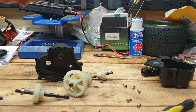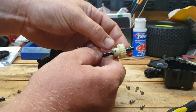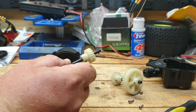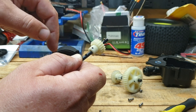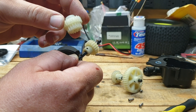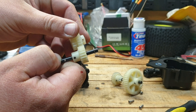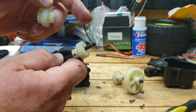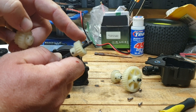The other thing is the gear that comes with the 5153X kit — the gear that comes with it is actually too big. You can't fit the gears in; the mesh isn't correct. So you end up having to punch the rolled pin out of the original shaft. This is the gear that came with the kit — it's just not the same size, and the depth isn't right either. This is a trick that no one else really explains. The only reason I found it was when someone else did the conversion and I ended up asking them, and this is what they told me — and it worked perfect.